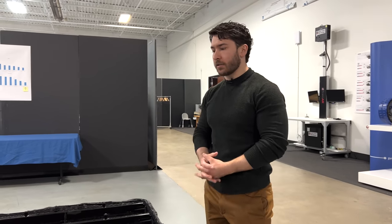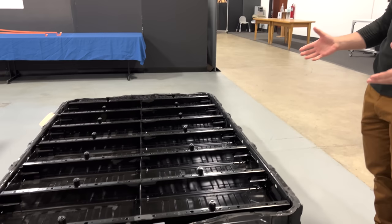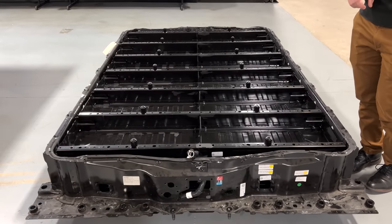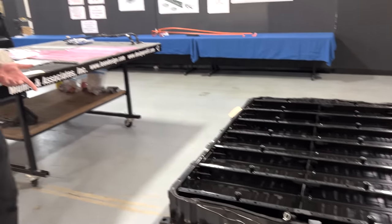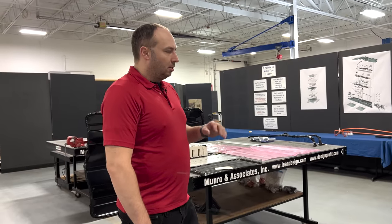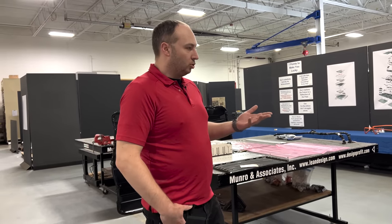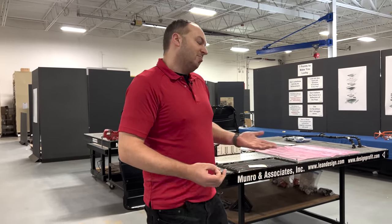This is a unique execution compared to what we've seen. Overall, the battery pack has 24 modules in total. We effectively have two parallel battery packs inside — one for drive mode and also for charge mode. It's more efficient to charge at high voltage, so they use the 800-volt system for charging. Splitting it into two packs and making them essentially parallel saves on the amount of current you draw. Extended range by putting them in parallel, and faster charging by putting them in series — kind of clever.